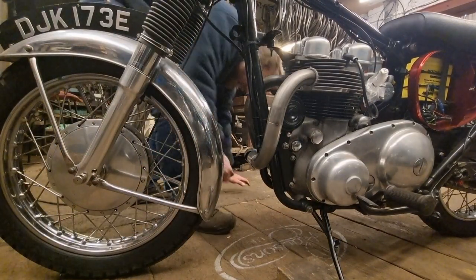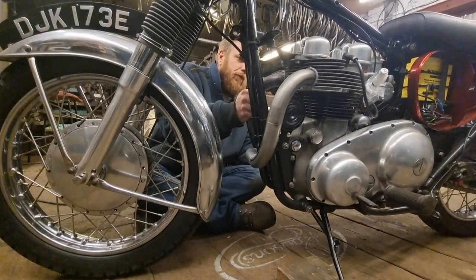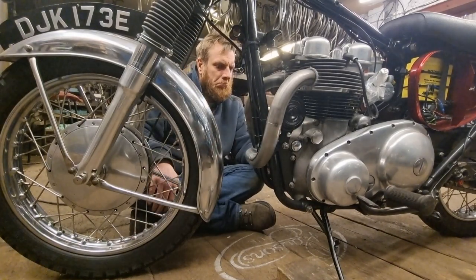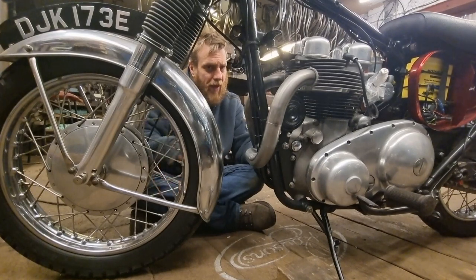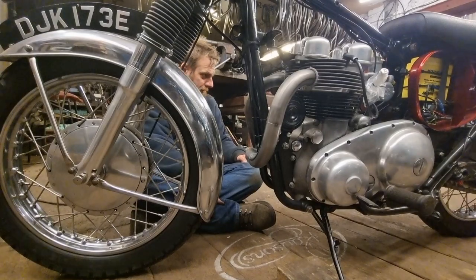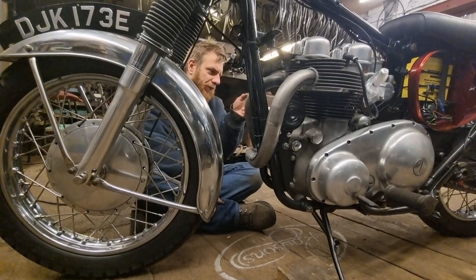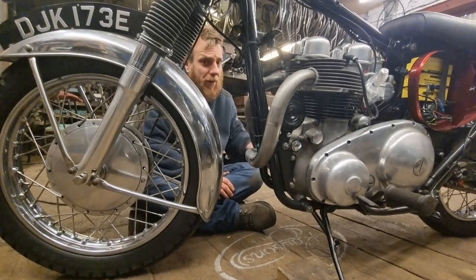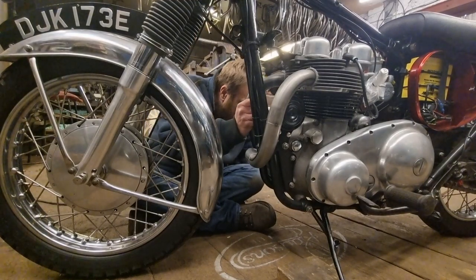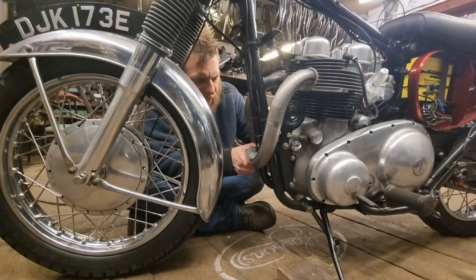Let's see if I can get that a little bit closer in. Looking good. I'm going to start trimming that tailpipe in a little tiny bit, and also while it's off I'm going to trim 10mm off that just so I can get the bracket in place — just so this is sat in the right place. I want to make sure that bracket's on the right bit, because at the moment this is touching the peg and I want to pull it a little tiny bit away, but that'll end up bringing that branch out a bit like that.